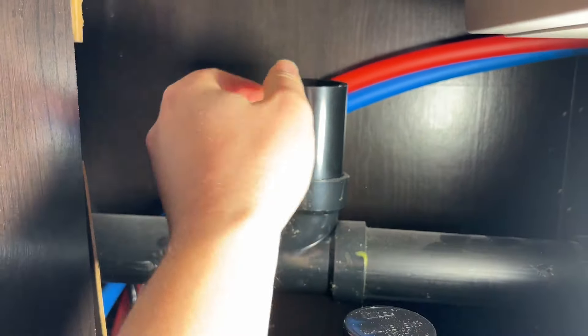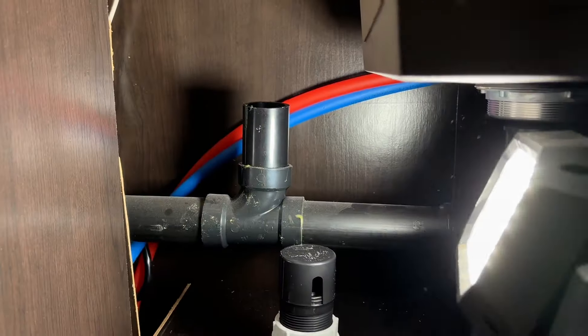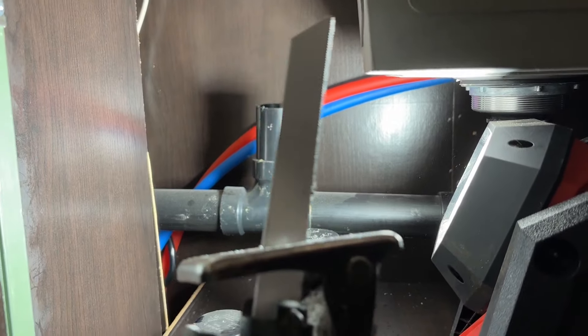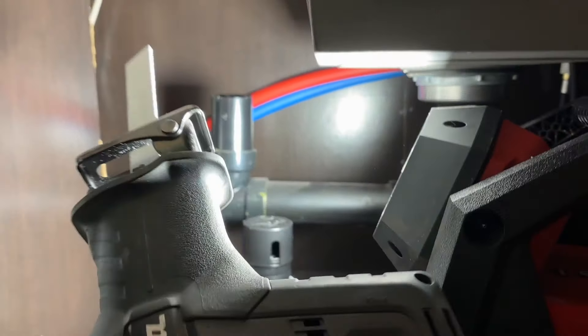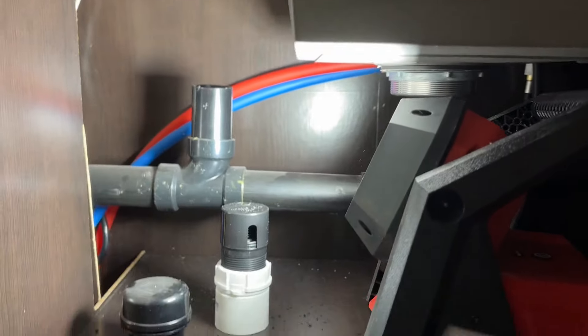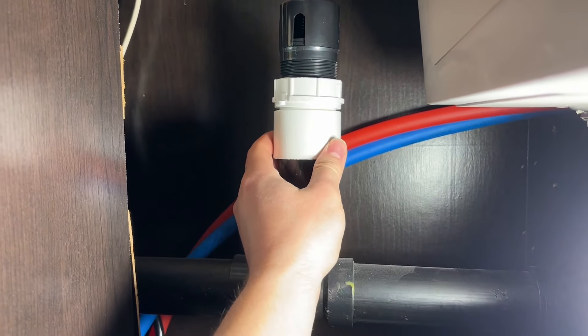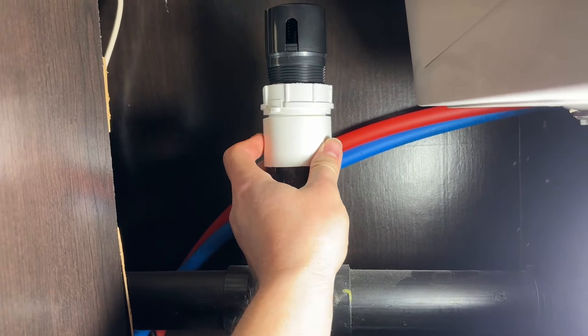That took just a few seconds with the sawzall. I used a really short blade on the Makita subcompact — a metal blade, because for ABS plastic that works really well and it was able to get in there no problem. Also make sure you hold the pipes when you're cutting to keep vibration minimal. Clean off any burrs before you re-glue the coupler back on, and make sure you're cutting it down far enough so you can still get the filter back off. You don't want to glue this on and find you can't remove that filter.